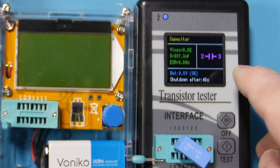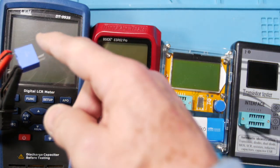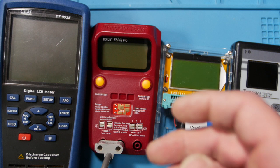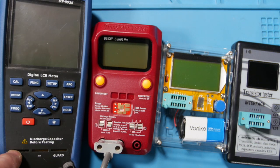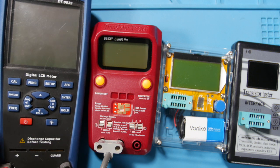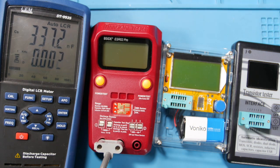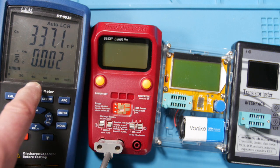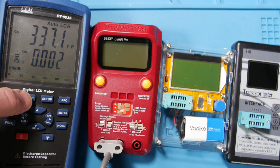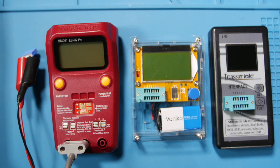This is version 2.4 by the way. It reads 337.3 and 0.6 ohms. Now using the CEM with clips attached — I'm not using the slots since the positive slot spring tension didn't come back together. Turning it on, it reads 337.2. That 'D' is the dissipation factor. This is at one kilohertz. Going to the ESR reading: 1.3 ohms.